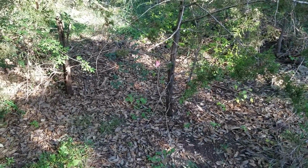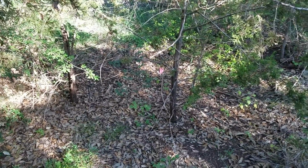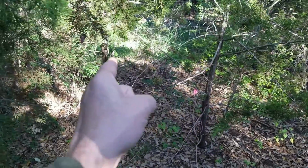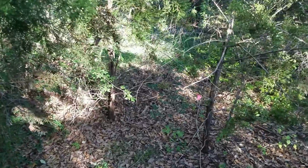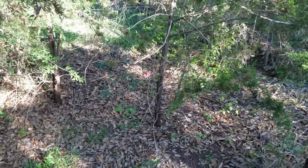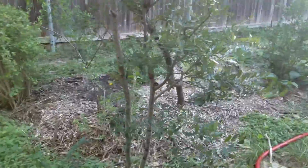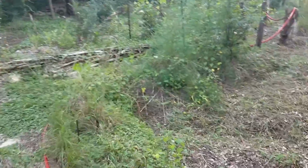It'll probably be anywhere from 4 foot to 8 foot in diameter. And its overflow will continue to go this direction and then flow down to the left and back into the natural creek bed and natural contour of the land. And I can use all three of these ponds, get a solar pump or a hand pump, and use them for irrigation, fish, wildlife, all that good stuff. And then they'll also serve as silt traps, sand traps for free soil.